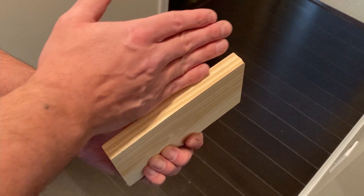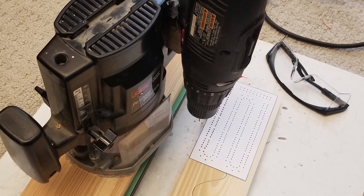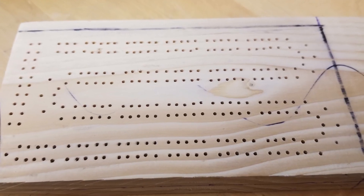I knew I was going to have to thin it down from three-quarters to three-eighths inch thick, but I left that for a future Chris problem. Then I made a setup using a plunge router and an electric drill — I basically glued the drill to the router, put some spacers in to make sure the drill was straight up and down, set the router to the right depth, and started drilling the holes.